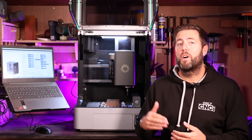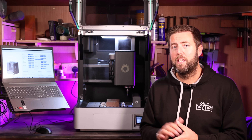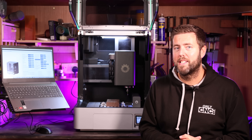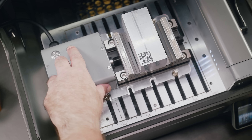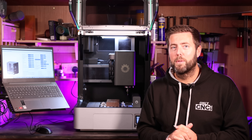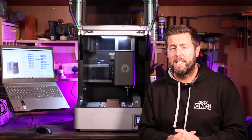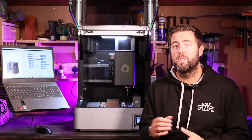There are a couple of additional accessories that can be purchased on top of the core machine. One of those is a fourth axis — I do have this in the shop and will be reviewing it as part of the next video. You can also get a 5 watt diode laser that fits underneath, allowing you to do lasering as well as CNC routing. There is also a power clamp — basically it automatically clamps onto your material as tight as it can without damaging it, making life easier than manually tightening bolts. There is also an MPG, which is a hand wheel you can use to jog the machine about. A lot of CNC users like these and you often see them on industrial grade machines, so they're very nice to have.